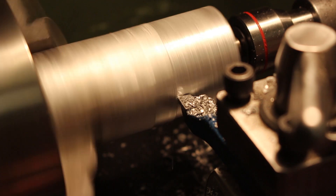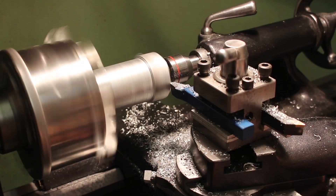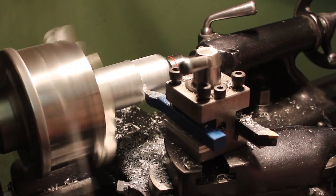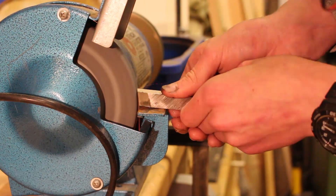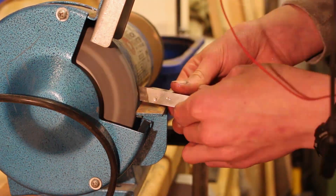I was originally using some cheap carbide tools for turning and they weren't working very well, since they were made for cutting steel not soft aluminium — they were leaving an absolutely terrible finish even with a really light depth of cut. So I decided to grind my own high speed steel tools on my bench grinder, and it turned out really nicely. I made it very sharp with a very small end radius and it cut very well, leaving a much smoother surface finish.